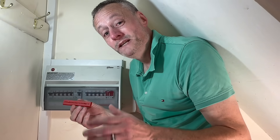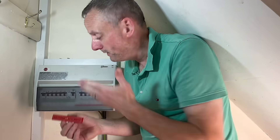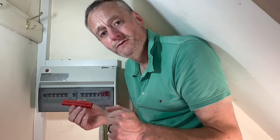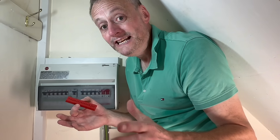You can see how the mouse stick sits in this gap without causing any issues, and only if activated will it do its work — it's a little passive device. With the mouse stick in place, I'll put the consumer unit cover back on and re-energize it. It looks like the only thing getting warm in this area is me! Is the mouse stick a solution you might use when you come across a plastic consumer unit, rather than putting in an invoice for a thousand pounds? Leave your comments below, and if you want to work out whether a property needs a rewire, check out the video on screen now.